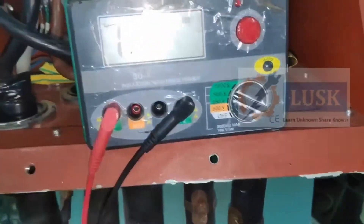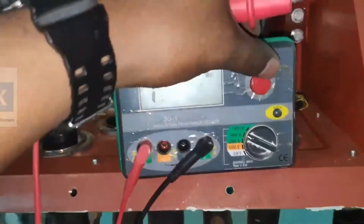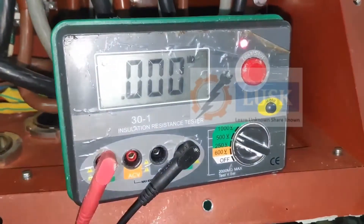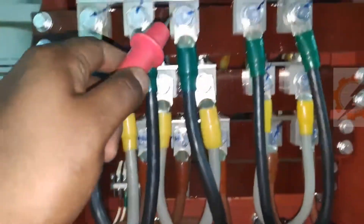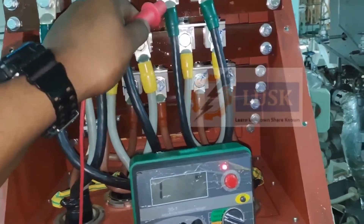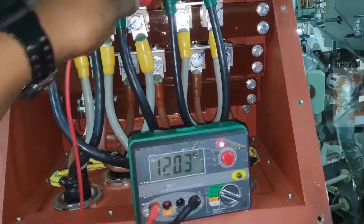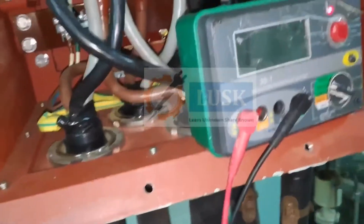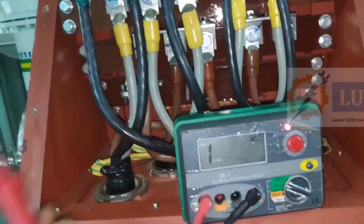I will do the megger test. As everyone knows, first I will connect one lead to the earth side and the other end also to ground to check the meter is working properly — it should show zero. It's showing zero now. Ground and phase — normally a proper megger test should be done for more than 10 minutes, but for the time being I am going to show each unit quickly. It is showing around 1200 megaohms, which is good — above 5 is good. Here it's 1500 megaohms, so the motor condition is very good. That's it: contactor maintenance, motor terminal tightness, and megger test.